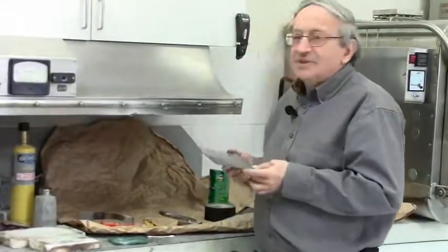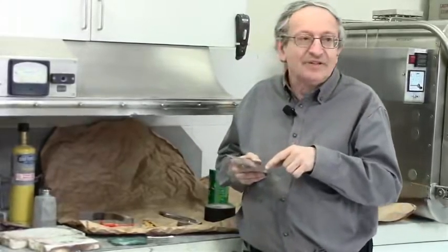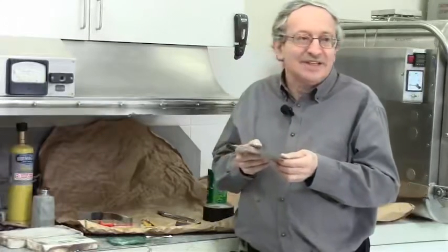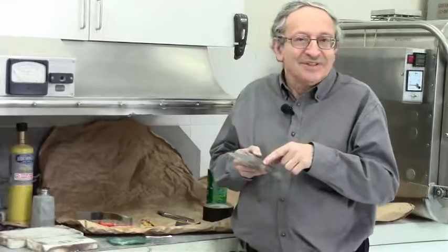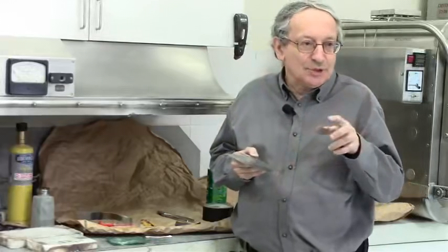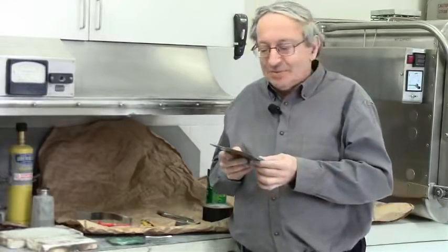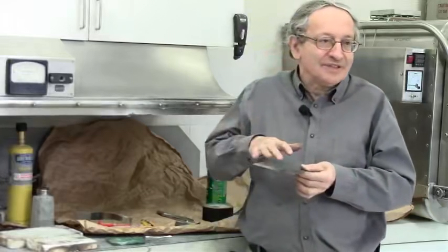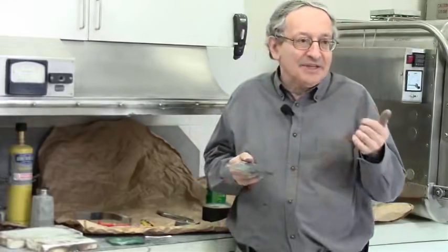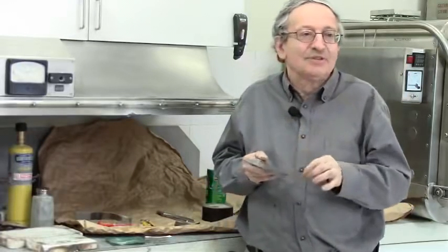Now, a very important thing to understand is that all these effects, the wetting effect, disappear in about an hour. So if I come back to this piece next day, none of these will wet. And the reason is the air is full of hydrocarbons, and by adsorption, the hydrocarbon molecules will recoat the item. So everything has to be painted within 1 hour of activating the surface. The same for glue bonding or any surface operation, plating.